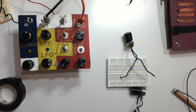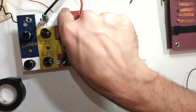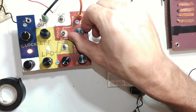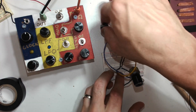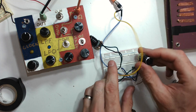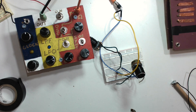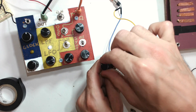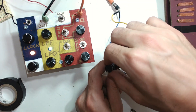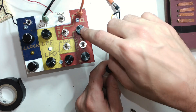Let me go back to the probes and experiment with a couple of things on the breadboard. This is nice because you don't have to make a whole new oscillator module to try out different sources of resistance. Let's say I wanted some finer control over oscillator one's pitch — so I'll wire in a 100k and a 10k in series. That just goes into the probe with leads into the breadboard. This is the coarse one, the 100k, just like the knob we have there.